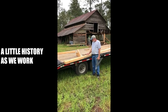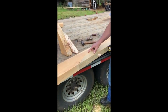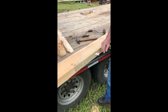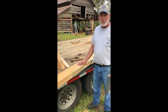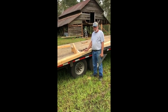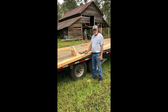Today we're building this beam to go across the front of our barn. What we've done is made what I call a sliding scarf joint — this joint is at a skew angle to the width of the material, and we've put it together with a one-inch round dowel rod. This is reminiscent of the timber frame craftsmanship of the past. You'll find this particular joint in this particular barn, so we're just trying to keep things the way the old-timers did, and doing that is one of the things we're most proud of — it's part of the passion we have for restoring these old barns.